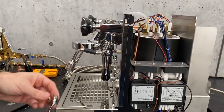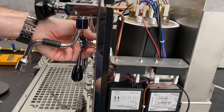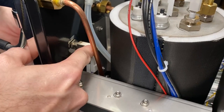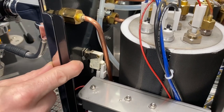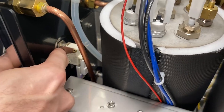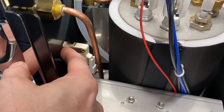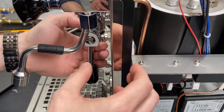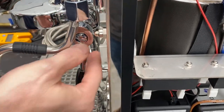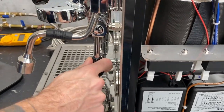What we're going to do is, with a 14-millimeter wrench, we're just going to loosen this nut up in the front here. You don't need to take it all the way off. Just unroll it, and if you're looking from the back, you see another nut right there. We want to turn the machine off first. So, what we're going to do is roll this nut forward, which is going to pull the entire switch backwards — you're just changing the position of the tip of that switch relative to the cam on the lever. I'm going to leave it just slightly loose right now, and we're going to check and see if we've gotten the right position.